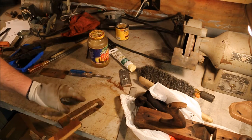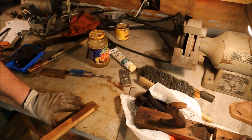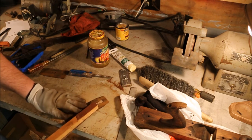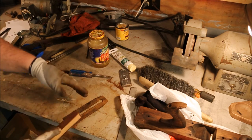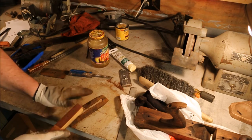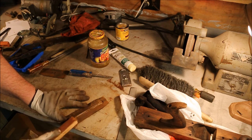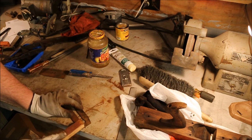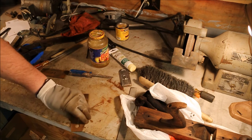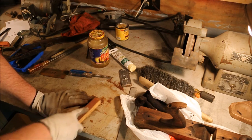And since it was a Fairlane, it had, I forget the year, but it had the curved body panels. It wasn't something that you could just go down to the local junkyard and find one. It was kind of a unique body style. So we spent about 6 hours laying Bondo into that body. Now you'd think that you just take the Bondo, you put it in there, lay it up, and you got a 2-inch thick piece of Bondo you got to fill. You mix up a big gob of it, stuff it into the hole, and put in 2 inches of Bondo. Well, that's a sure way to have it fall out. That's probably why it fell out and it went across the railroad track. You have to lay it up no more than 1/8 of an inch at a time.